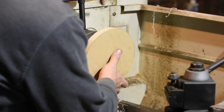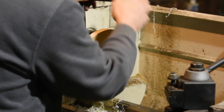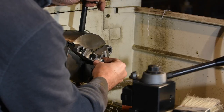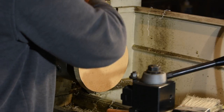I'll reverse the jaws on my lathe and chuck up the blank, making sure it's nice and flat to the jaws. I'll use the drill chuck on the tailstock to bore the hole — first a pilot hole for accuracy, then a 5/8-inch drill to match the size of the arbor on my bench grinder. Now I'll reverse the jaws again to hold small stock, using a little mandrel I made — basically an aluminum rod turned to the same diameter as the arbor, then drilled and tapped for a 1/4-20 screw.